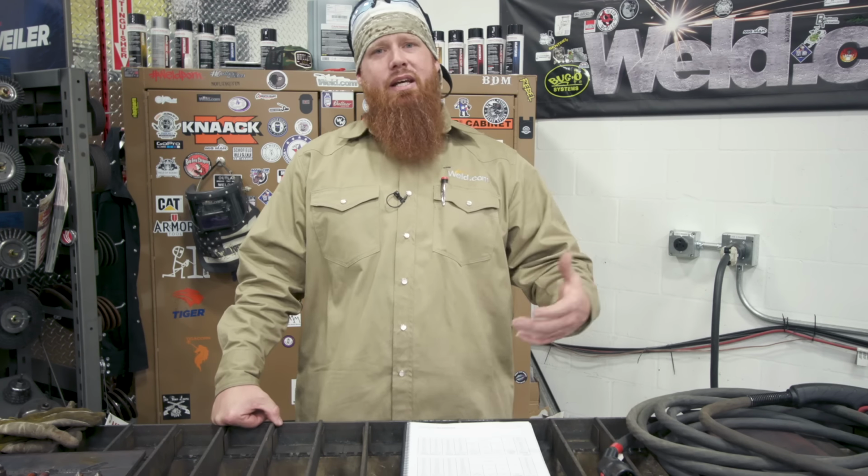Whereas with oxyacetylene, it has to contain iron, right? Because oxyacetylene is a chemical reaction. It's basically an accelerated rusting process, so it's limited to items that contain iron. So you can't cut non-ferrous items like aluminum or stainless steel, chromium, nickel, anything like that.